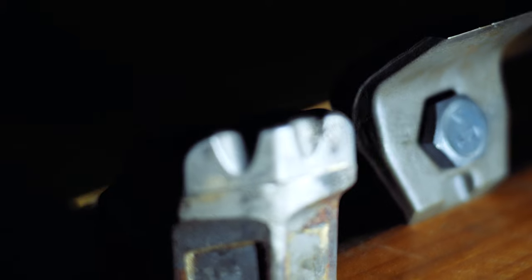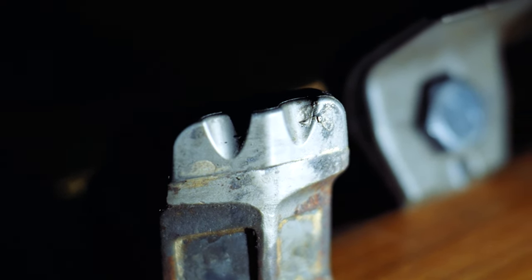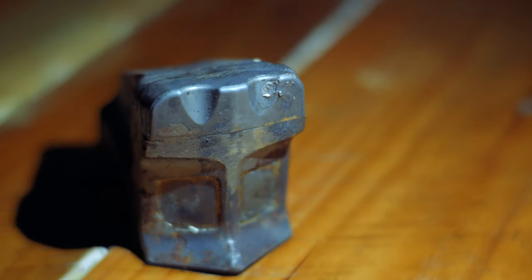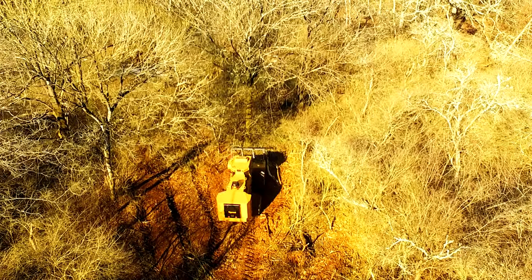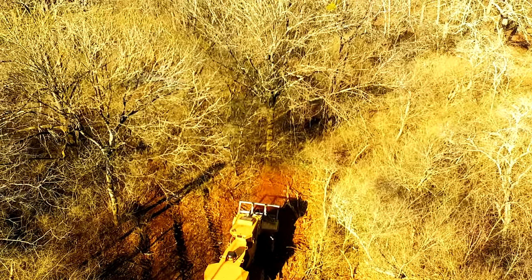The second type of tooth that is very common is a carbide-style tooth. This tooth does not have to be sharpened and lasts a very long time — anywhere from as few as 100 hours up to 500 hours, depending on the terrain and material. Carbide teeth are great for rocky areas, sandy areas, and areas that have impervious material that is very rough — something that would actually chip a knife-style tooth.